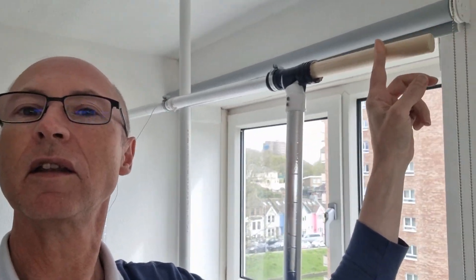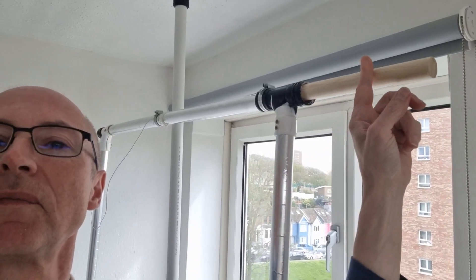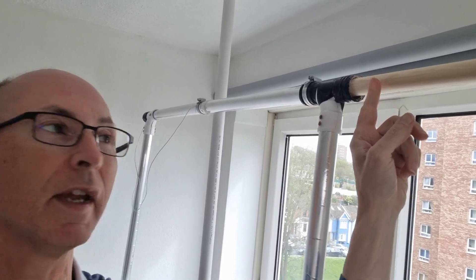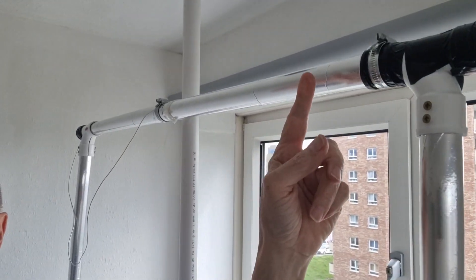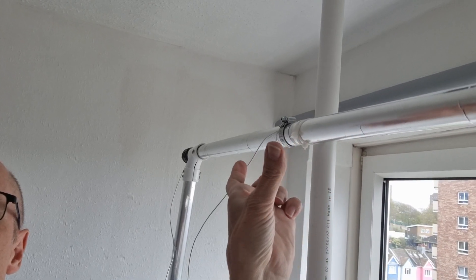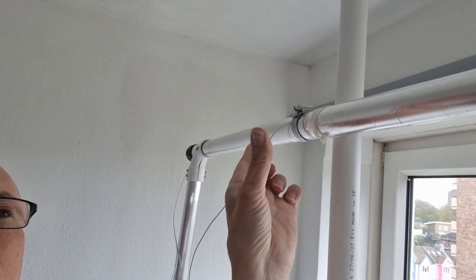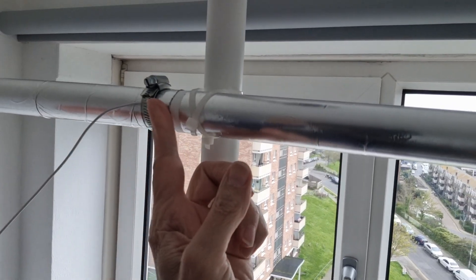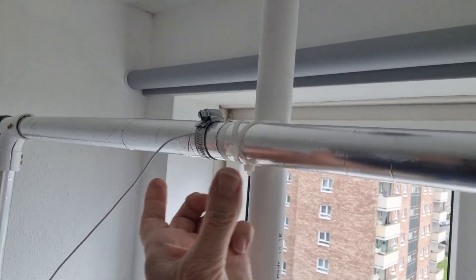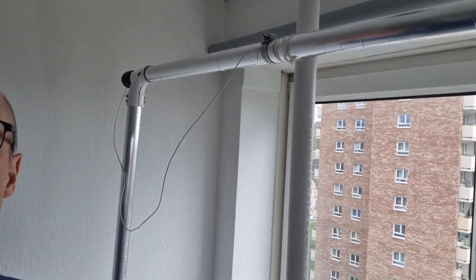So it's a loop which is tuned using this wooden stick at the top here that slides in and out. Looks like a broom handle but it's not. This has aluminium foil over part of the length so that when it's over this part the capacitance increases, and then as the metallised part of the stick moves down here we have less capacitance because there's a gap in the centre right there. So it's a loop with a gap in it and then a sliding metal part to adjust the capacitance to tune the loop.